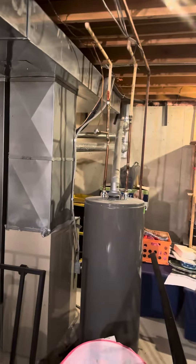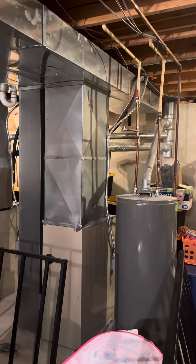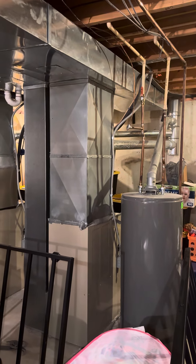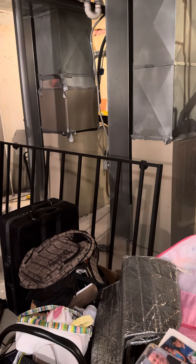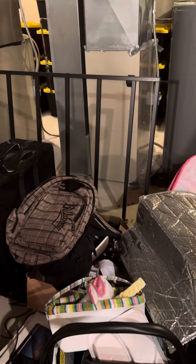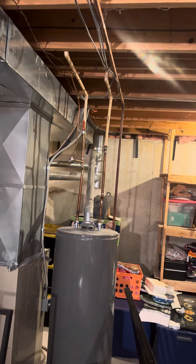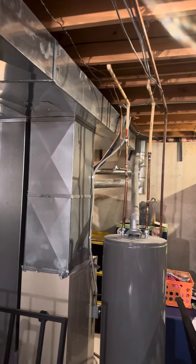And then you can see the air conditioners — you can see the back of the rack. There's actually a six-inch flue coming down. So if we do the furnace, we'll put on a new swivel tee, a new cap, run four inches to the furnace. The condensation drain — you can see it's just at the side of that water heater.